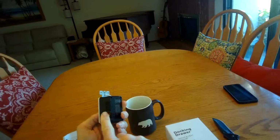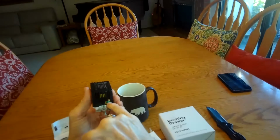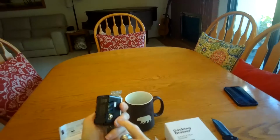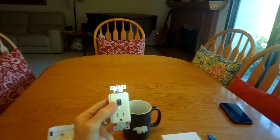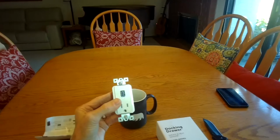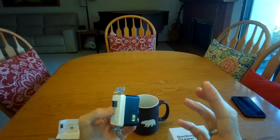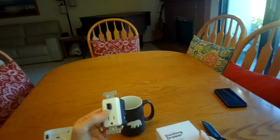And this is just your regular type of outlet. It's easy to wire. Put your ground wire here. You put a power wire here, the load wire, the black one. This one is the white one. Easy to install. And what it does is if the device senses that there's some heat, excessive heat or smoke, it'll cut the power, and that'll stop the whole fire from really getting going, because without power, the device electronics that were malfunctioning will not overheat. So it's really a neat idea. Could stop a lot of house fires.